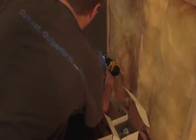WEDI tab washers are now installed with WEDI screws, either wood screws or steel stud screws, starting in the corner of the framing and approximately 1 foot above the base surface. The bottom row of washers and screws is installed first while pushing the panel into the sealant and the channel.